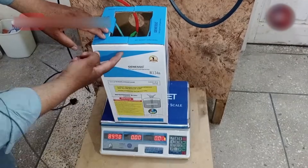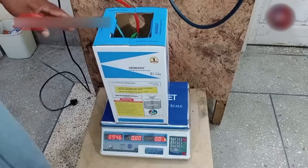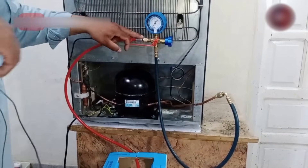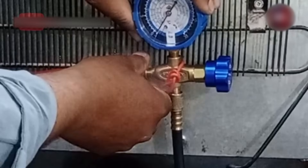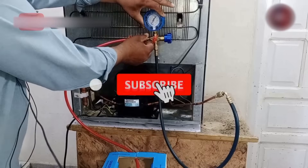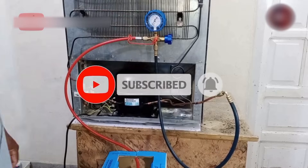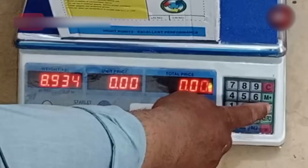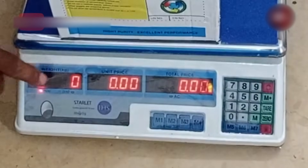This cylinder's face is upward so that the liquid will go inside the system. So first, I will remove the air out from the pipe of the cylinder. I will open this red pipe a little — the air has come out of the pipe. Now I will tighten the red pipe back again correctly to prevent any air from going inside the system. I will put the weight machine to zero by pressing the TR button. The scale of the weight machine is now showing zero.